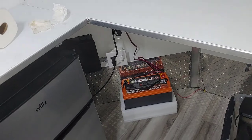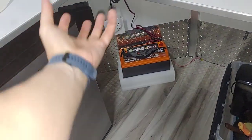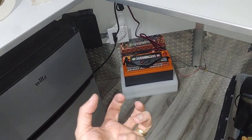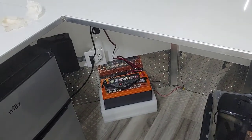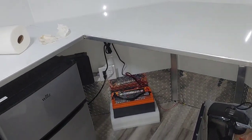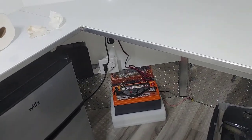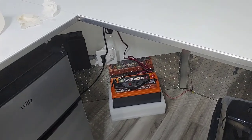This setup also supports a generator. All I'd do is plug in my 110 on the outside, the generator provides the 110 the rig needs, and it would be charging my battery at the same time because I have an automatic charger. The Victron charger has Bluetooth so you can see in detail everything that's happening. It also has customized settings — I put in the settings for my LiFePO4 battery that I looked up online. If you have questions about that, comment below and I'll point you to where I found those.